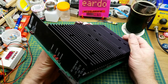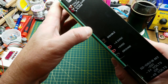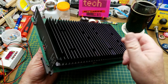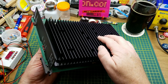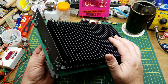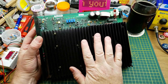This thing is out of the multiplexer section of an old Harris Farinon microwave system. The mux was called a DVT mux — either a DVT 16 or DVT 45. Those are multiplexing T1s into higher-rate signals, either DS2s in the case of the DVT 16 or DS3 in the case of the DVT 45. It's been probably 15 or 20 years since I last saw one of these powered on. I'd guess these were made in the 80s, but maybe we'll find a date code on one of the chips.